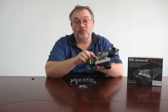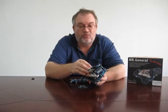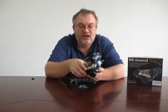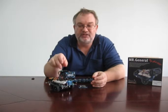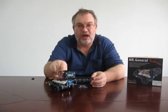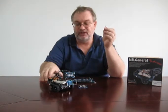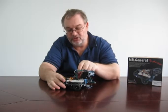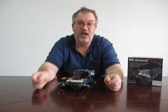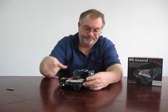We have a breadboard. We use the breadboard so that we can plug in any processor we want and wire it up however we want. The kit is currently supplied with an Arduino Atmega 8. This can be programmed with the Arduino IDE and this USB interface. Basically, you plug your USB interface into the breadboard, plug in your cable, use the Arduino IDE to upload your software, and you're good to go.